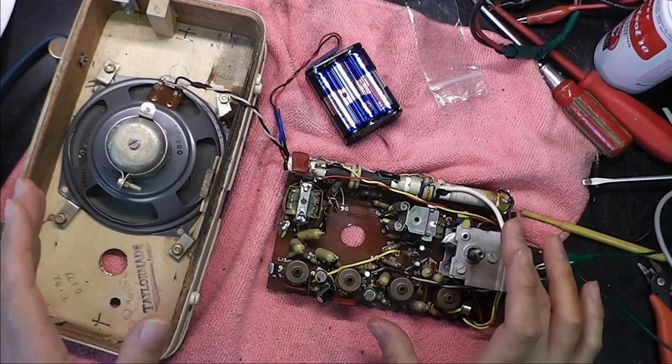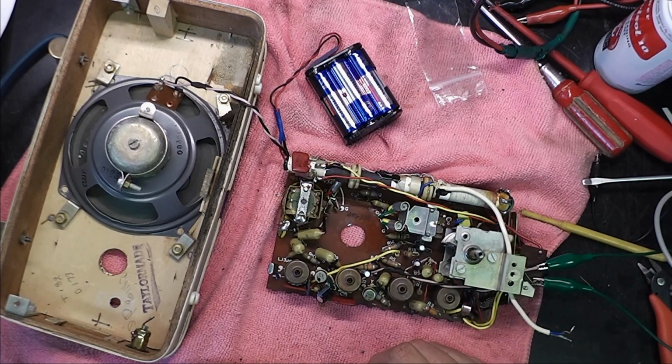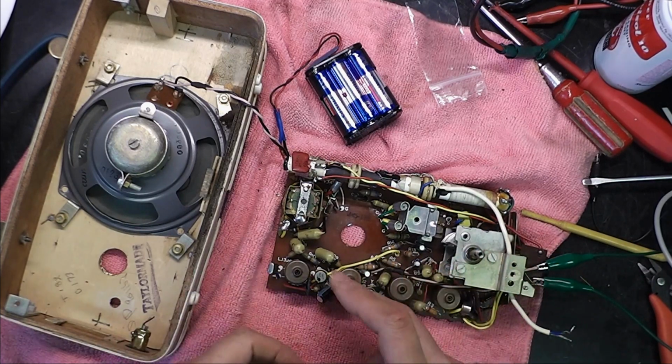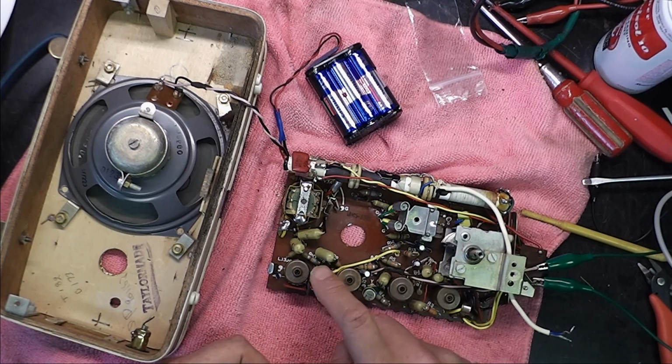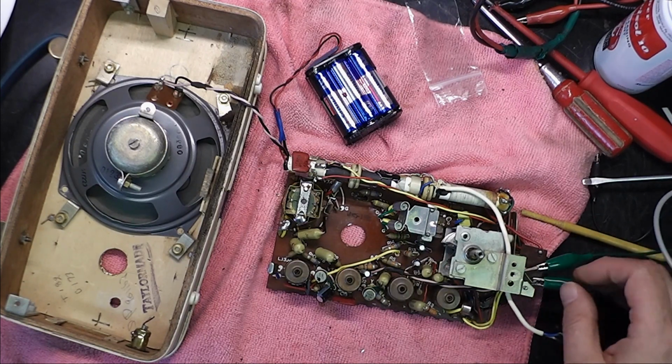I couldn't find an NKT 164, but I had an NKT 163 that I've now put in the reflex IF AF, that's a bit of a mouthful, stage. I've just been listening, I've heard no signs of crackling. Yeah, I know it's the wrong transistor, but needs must, so it'll just be a case of seeing if it's any good now.